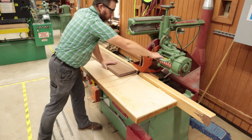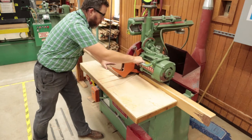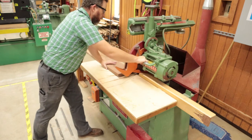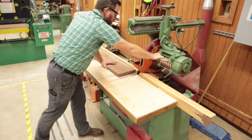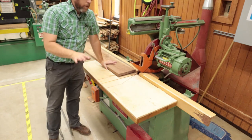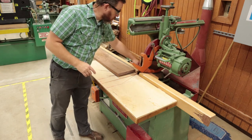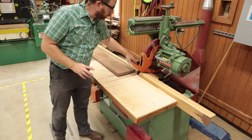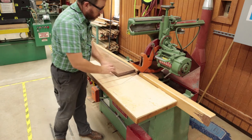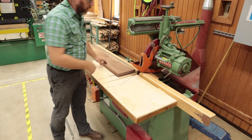Let me show you a sample cut. I'll come through and go all the way through the board. Once I do that, I lower the saw all the way back, shut off the machine, and wait for the blade to come to a complete stop before clearing anything off. Before starting your cut, make sure there are no off-cuts in the back area, near the blade, or in the blade groove that the blade can hit. Clear everything off before turning on the machine.